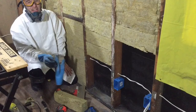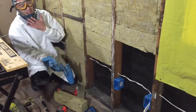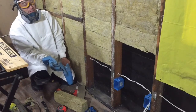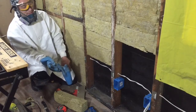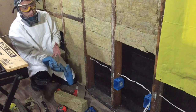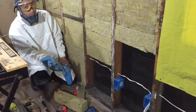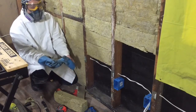The easiest way to do it is to have your gloves on and your respirator on. If all you've got is a paper respirator that's fine, but they tend to go bad on you and actually fog up worse than the half mask. I'm wearing the half mask right now because it lets me talk more easily, but otherwise I'd go with the full mask because your throat will get itchy when installing this stuff. Even though mineral wool is safer than fiberglass, it will still irritate your lungs and throat, so a respirator and goggles are definitely a good idea.